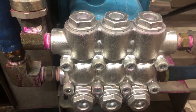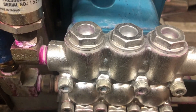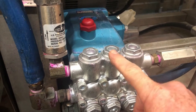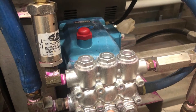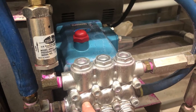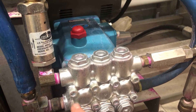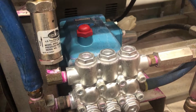I'll show you today how you can change out the O-rings in the valves of this 2150 CAT pump. In these 2150 CAT pumps, the valves are in this section right here. You can take this cap off — there are six valves: the output and the intake valves. Behind these sections here are the pistons. There are ceramic pistons in these. They also have O-rings and seal valves, but we're not going to break it all the way down today — we're just going to do the valves.